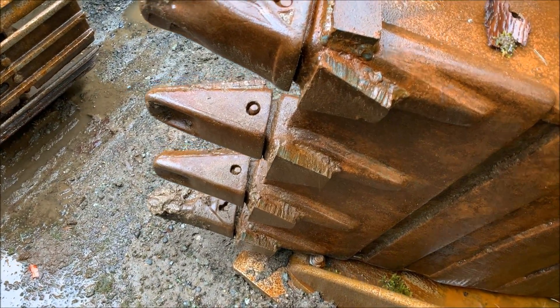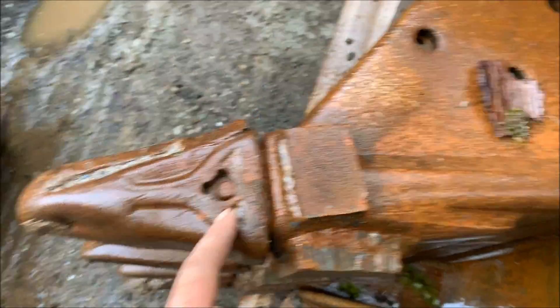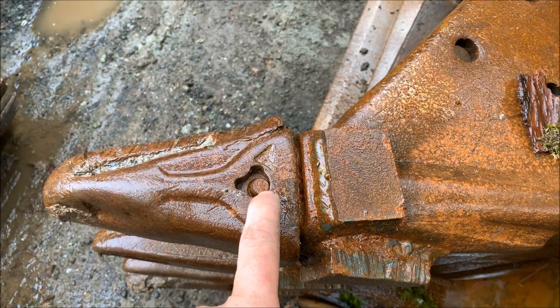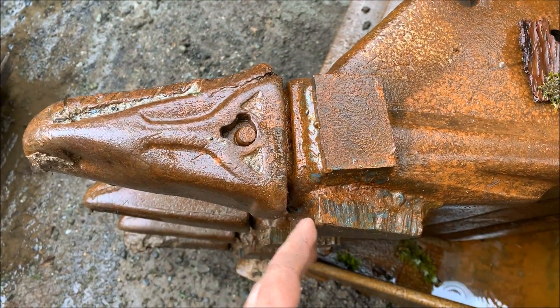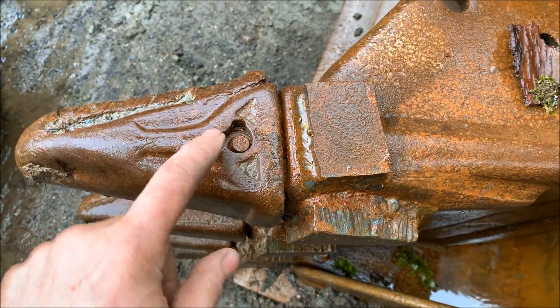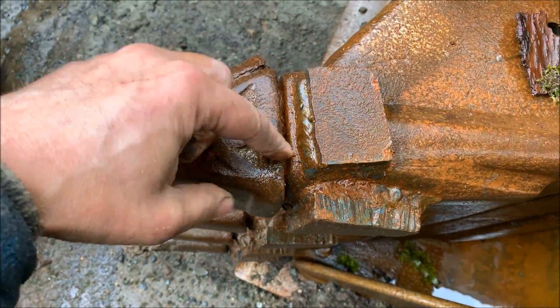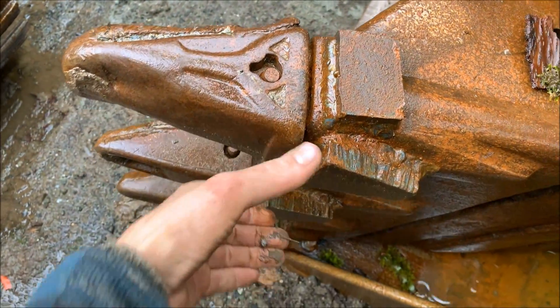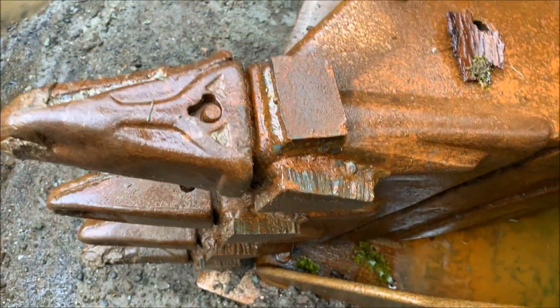I think this would apply worldwide. So these little pins here — this is a 135. If you give a backwards whack on this and catch concrete demolition, tearing apart a foundation, all that's holding that is that little finger-sized pin. All the back pressure goes on the pin, horseshoes them, the pin hangs lower and it falls off.